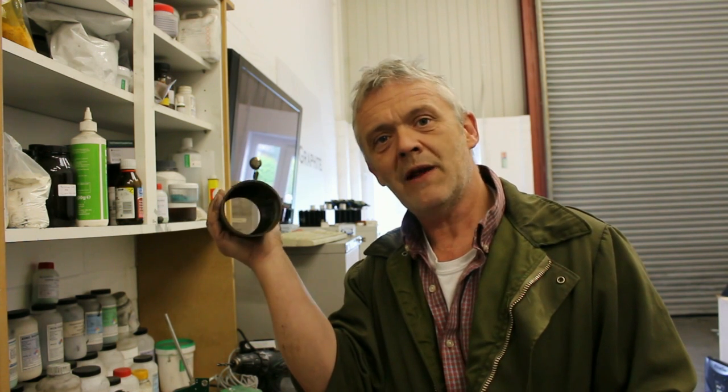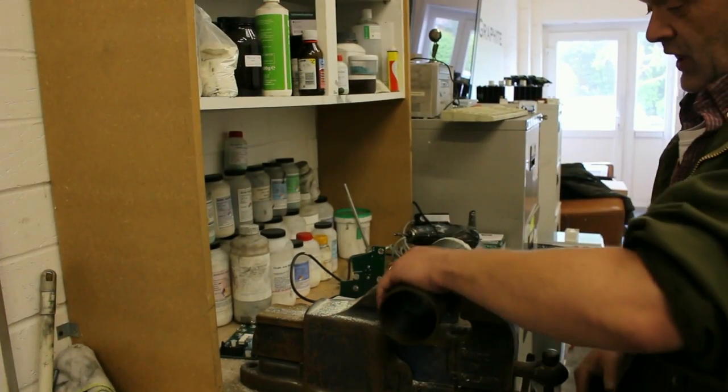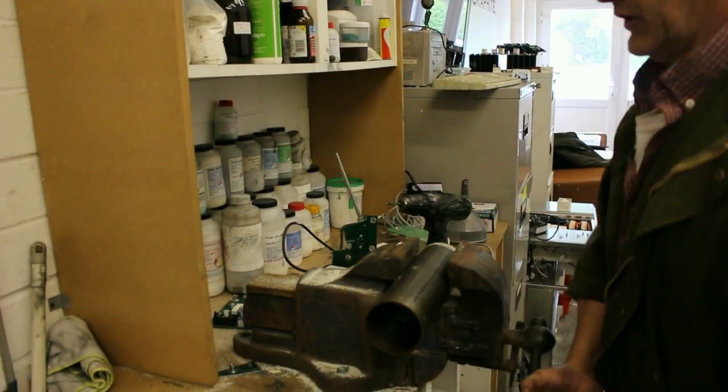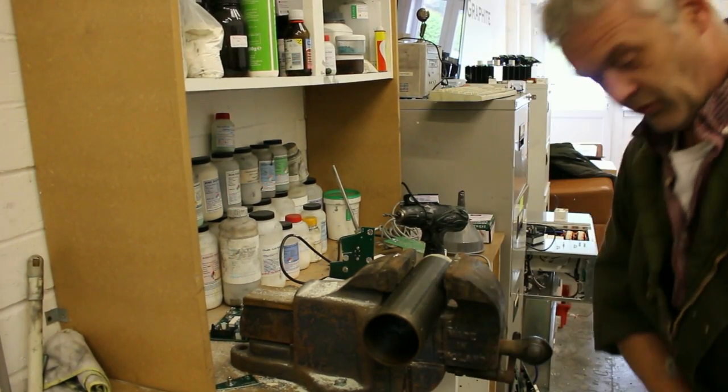This is a good old sturdy bit of steel pipe, actually 70mm in diameter, so that's obviously how big the coil is going to be. You bend the coil according to the former size that you want — I want quite a large one, because I want to put big things in there. You're going to need a workbench, so insert the former into something sturdy that can hold it, and then we can form our coil on there.